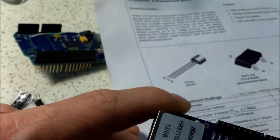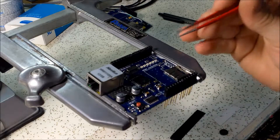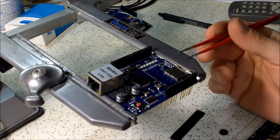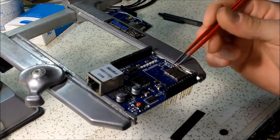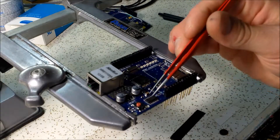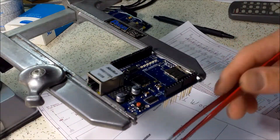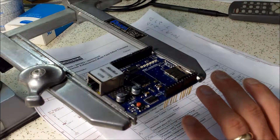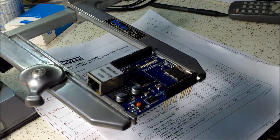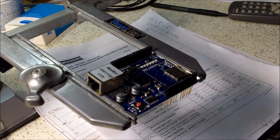This is a follow-up to my Ethernet Shield hack. I know what's going to happen - I'll post the video and everybody's going to say they want to see me do it, so I'm going to use this shield and actually make the mod. I'm going to take this LVC buffer chip off, put my N-channel MOSFET 2N7002 on this board, and show you how I did the mod. I'll use my hot air rework station at about 400 degrees, heat the chip up gradually, and pull the part off.